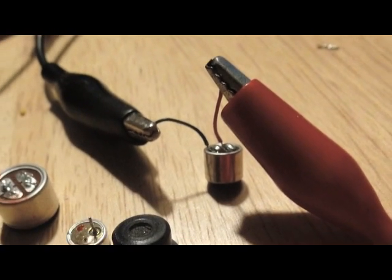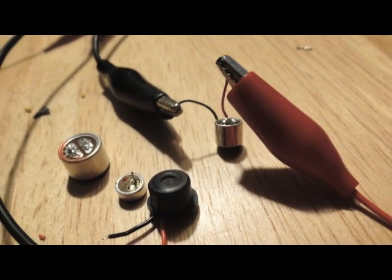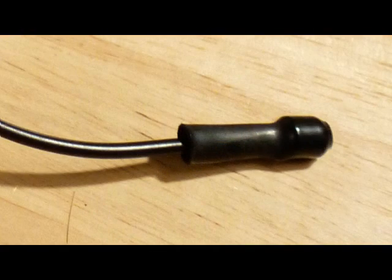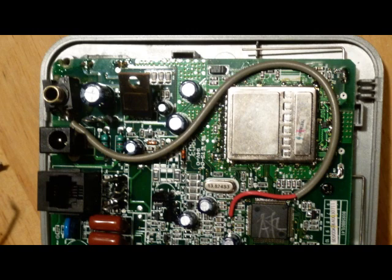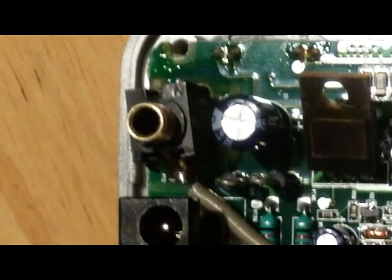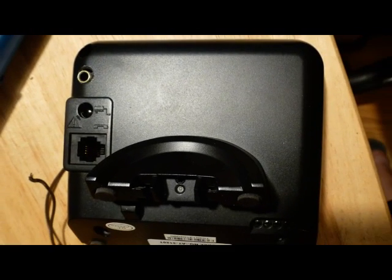But if you don't have extras, just use the one you removed from the PC board. Connect the microphone to the end of the shielded cable and protect your connection with some shrink-wrapped tubing. Close the handset back up and then make a nice job of the base unit with some more shielded cable and position the audio output jack on a suitable area on the base PC board. Drill a hole through the back of the base unit shell for the new jack and then close up the unit. That's it.